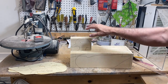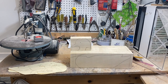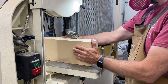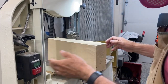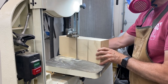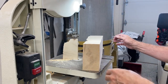I've got nice pieces of tupelo selected, with the patterns drawn on as you've seen in other videos, so I won't repeat that here — now we'll band saw the body and head out. I'm speeding the video up two times so we can watch the entire process in less time, but just know I wouldn't be cutting quite this fast under normal conditions. I've got the top piece cut off and I want to retain that. Now I'm going to go back and band saw that little area behind the neck — I just find it easier to do that separately than try to follow that tight curve on the initial cut.